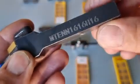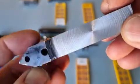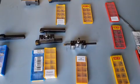I had to grind this down — you can see it's 16 millimeter by 16 millimeter, I had to take about three and a half mil off that. I milled it on the lathe. I'm using this now because I'm getting them quite cheap. Also, if you look at the typical diamond shape, you only get two uses out of it before you have to throw it away.